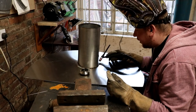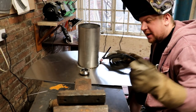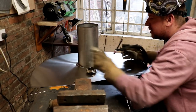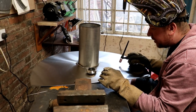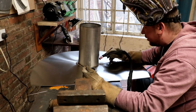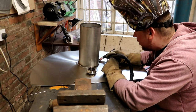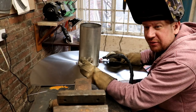The fit on this isn't absolutely great, so every now and then I come to a pretty big gap. Using this 1mm rod you really have to stuff it in there. Underneath I've got a piece of copper laid flat to try to back the weld, but as you can see it's starting to distort. Maybe it'll bend back — I'm going to go on the inside, clean off the coking, and re-weld on the inside at a lower amperage to fuse the metal together. We're talking two or three millimetres total thickness, which will allow me to fuse the inside without burning through, achieving full penetration.